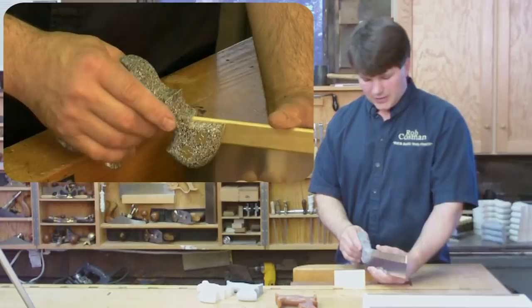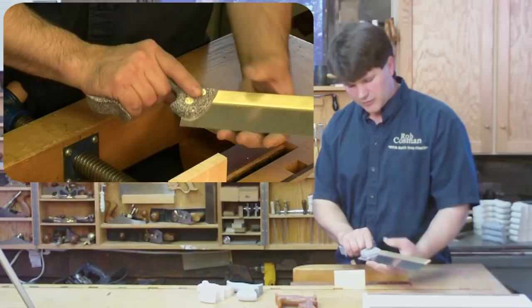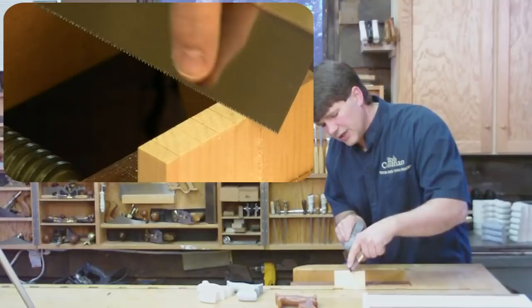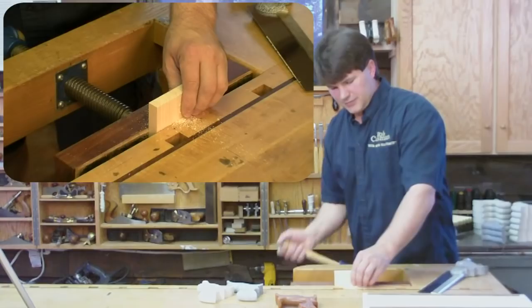There's no finish to wear off. It's waterproof. It's wider — about an inch thick — which really fits an adult male hand well. You'll notice we have three little finger recesses so that when you pick up the saw you can tell right away it's a three-finger grip. Index finger sits down the side just like this. Very light grip, and again pinch the wood with your index finger and thumb, press your saw laterally against it, and use that first two inches to just mark the wood.